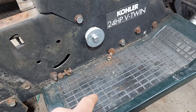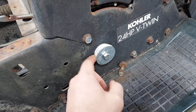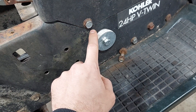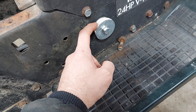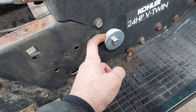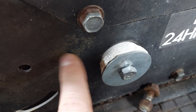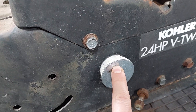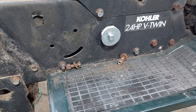I found this little bushing at the hardware store and filed it down. It's a punched hole so it's mildly tapered — measures out at about 40 millimeters, and across the threads it measured to about 44mm, so I just filed it down until it fit pretty snug. It can't go into the frame because of the nut flange, and then it's screwed in with some blue Loctite directly into the crossbar pivot rod. So it can't come out and it can't go further in — we're good.